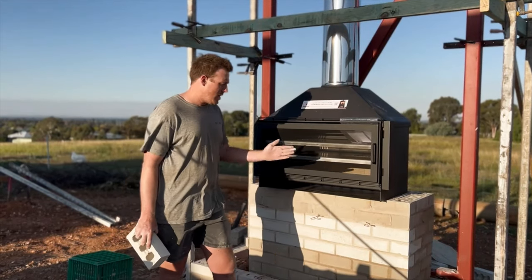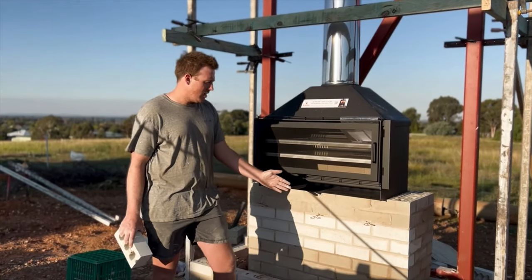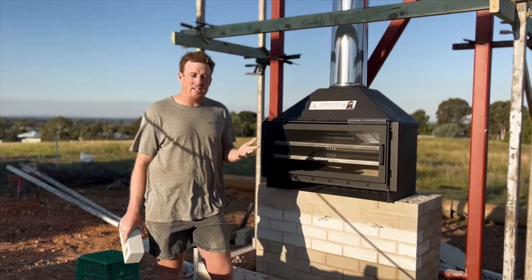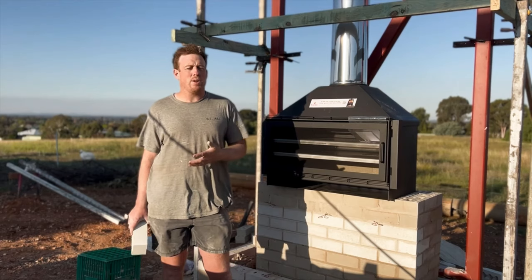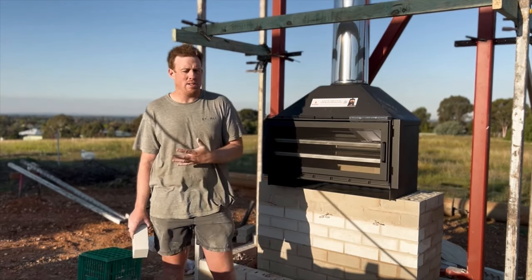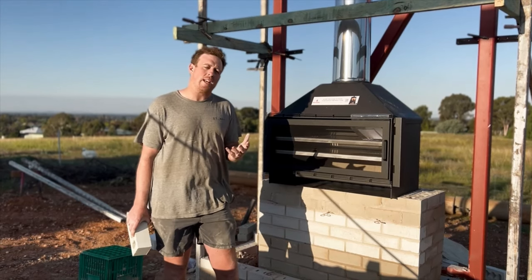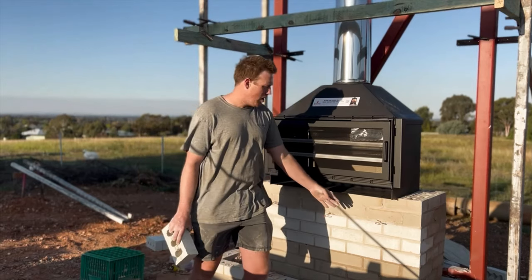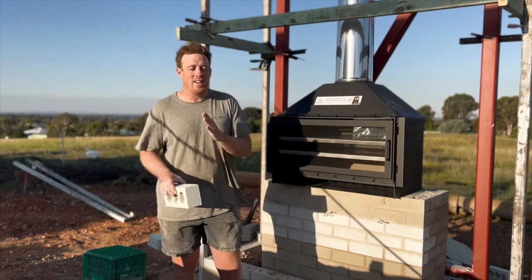So you can see that it's dried here and that it stands out from the brick. And the beauty of using the red natural sand to get the color over the creamy oxide is that the natural sand color isn't going to discolor anywhere near as much as an oxide. The oxide, when it gets attacked by UV light, it will fade over time, which means that a beautiful creamy beige mortar is going to end up white like the brick.